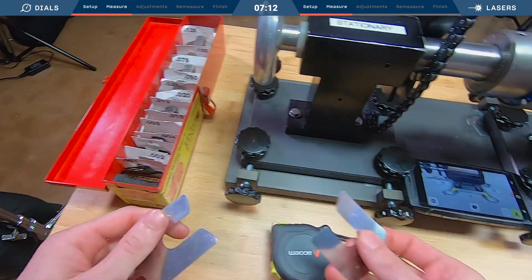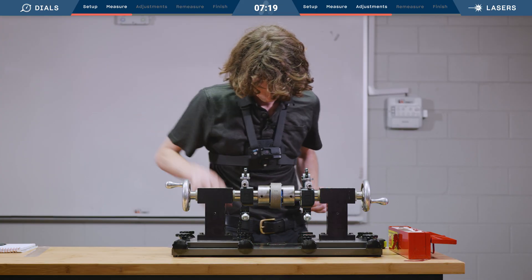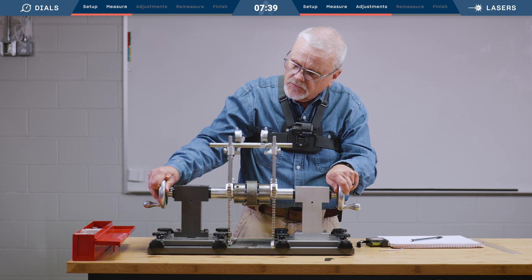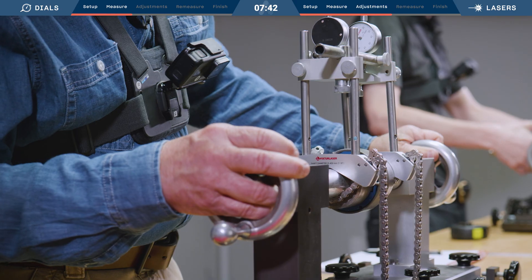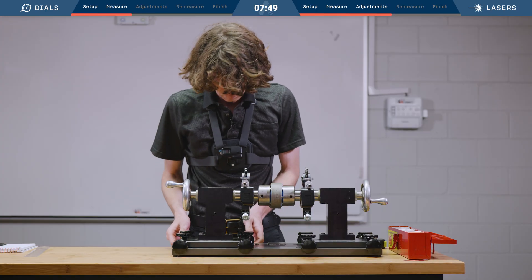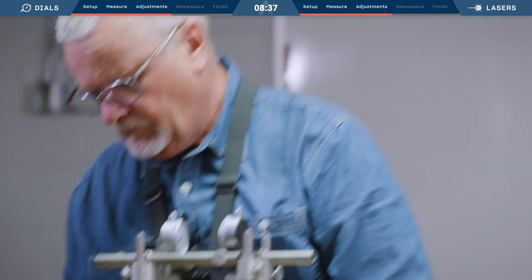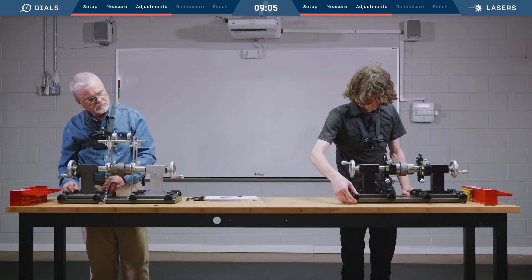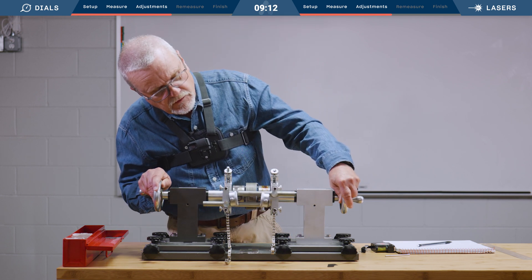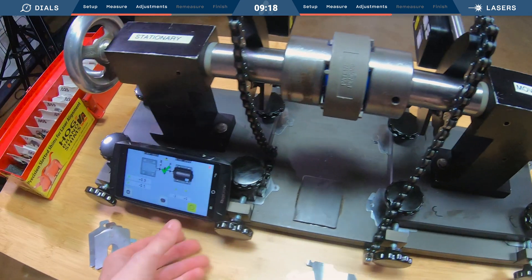Now that I've taken my three measurements, I have to calculate the six o'clock measurement using the validity rule. Grabbing my shims for a vertical adjustment. I have just set my indicators at half travel, so these are really going to be measuring live as well. I can calculate the shim values pretty much in my head or I could graph it out. I think it should be fairly close to vertical, so I'm going to roll around to horizontal and use the jacking bolts to make this final correction. First correction complete.